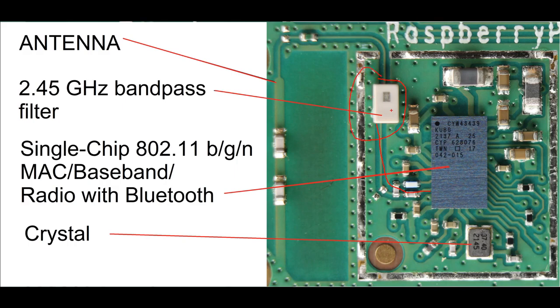The antenna runs up through a band pass filter, which takes only the 2.45 gigahertz ISM band and rejects all others. It comes up around through a resistor and then through components. You can also see a bunch of ground vias on this side. That, I believe, is actually a patented antenna — they mentioned in the documentation that they had to pay a license fee. RF engineering is a very complex field, and even though it's been reduced down to a circuit board trace, there was a lot of engineering involved. The other component at the bottom is just a crystal, which provides the timing reference for the chip.